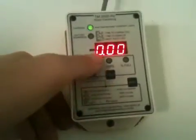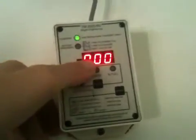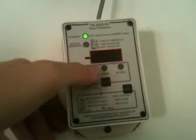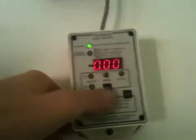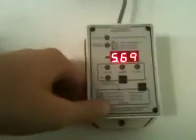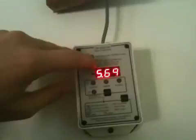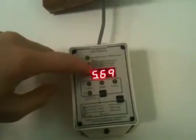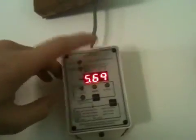This also gives you days since charged — right now zero days. Once I'm not fully charged yet it would be something like 0.05. When the charge light indicates, it resets the days since charged. There's also days since equalized — if you have flooded batteries you can program this to tell you when to equalize, so it gives you a reminder. It's got CHF for time to fully charge, CHE for time to equalize, and BLO for battery low voltage.